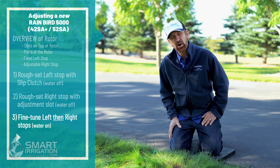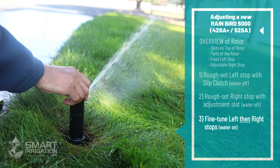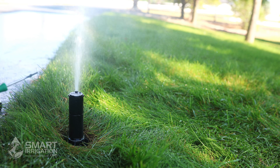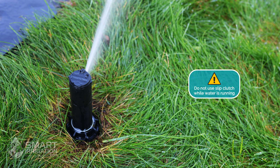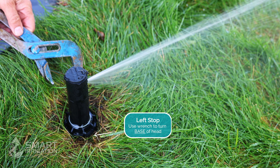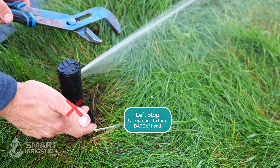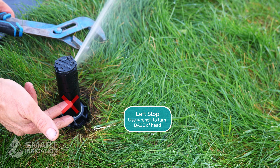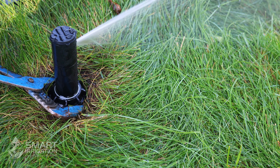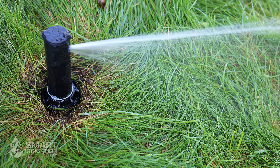The next step is to actually turn the water on, check the exact location of the stream, and fine-tune it while the water is running. We want to see where it naturally turns to the left. It looks like we're hitting the driveway too much, so we want to turn it clockwise a bit. We cannot use the slip clutch feature when the head is running — it can only be used when the water is off or you could damage the gears. So we have to use a wrench on the base. Never use the wrench on the stem or you could damage the plastic, which would damage the rubber seal when it goes up and down over time and prematurely reduce the lifespan of your head. So we get onto the base with the pliers and go clockwise in the ground — hopefully someone used thread seal tape on the threads below to make it easier.